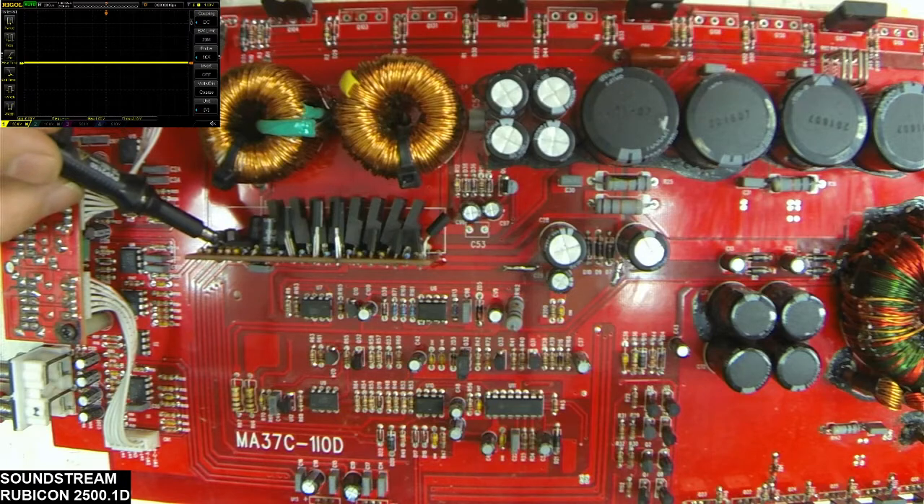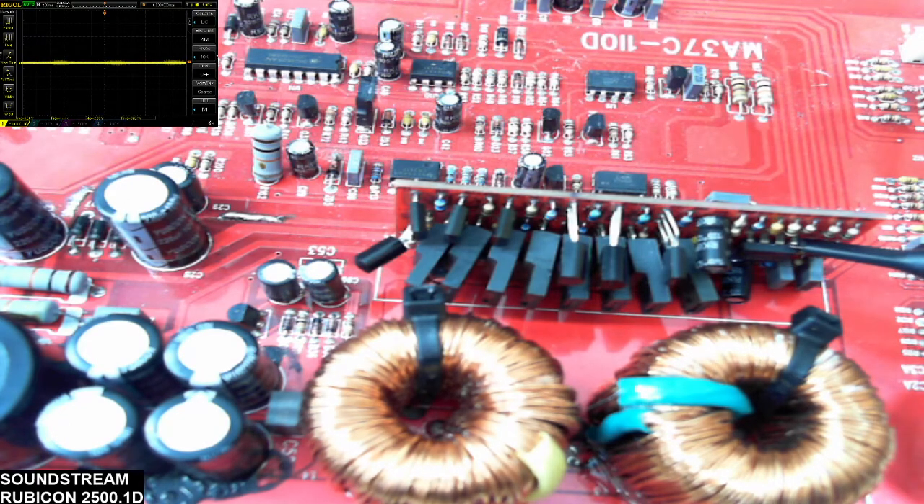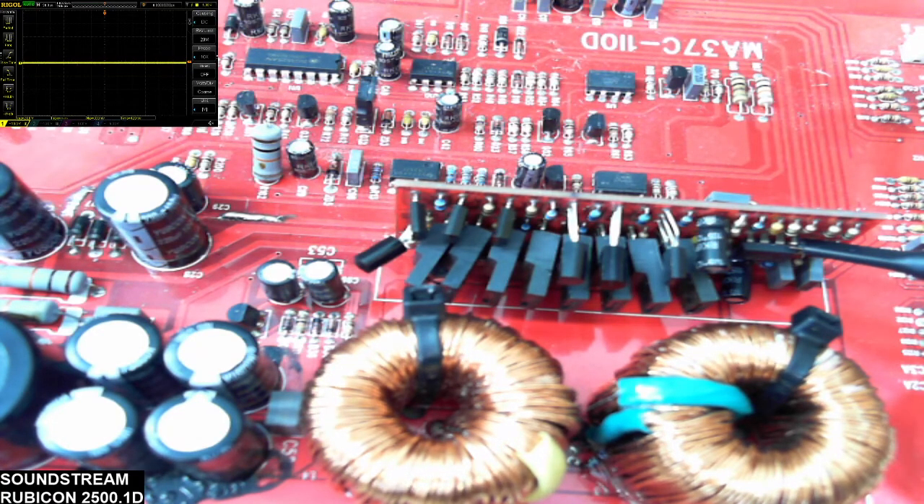What you'll do is you will see a square wave on pin one of the IC on the drive card. I switched this IC to a TL072, as I mentioned previously. So what you'll see is pin one of that TL072 turn from a square wave to a triangle — a modulated triangle I should say — when it gets the on signal. As long as you have signal coming in on pin one from your preamp section and you get that square wave to a modulated triangle wave on pin one of the TL072 on the drive card, you will see that you get output drive.